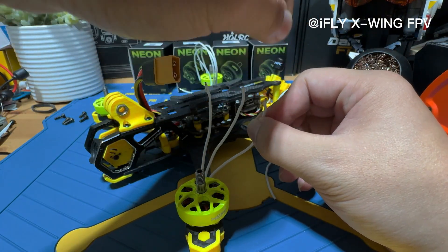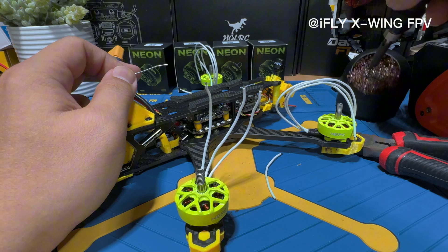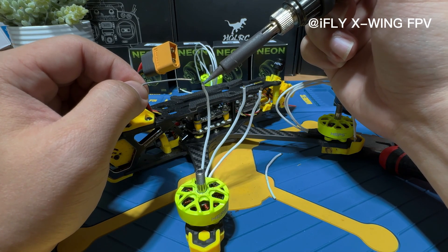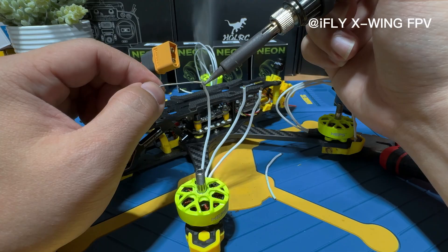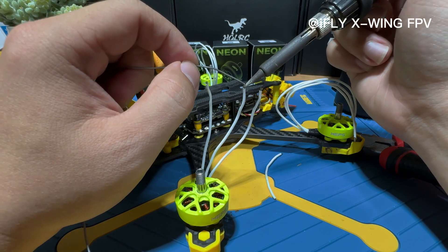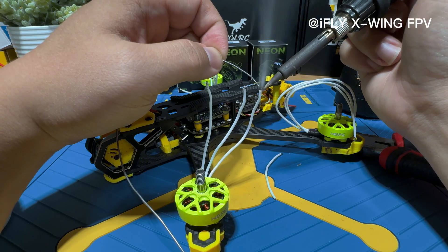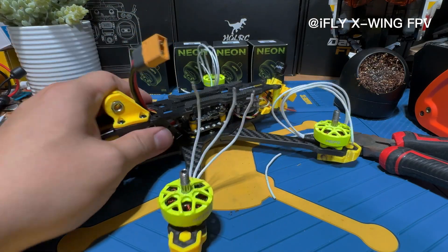The third part is you're going to have to pre-tin these wire tips, otherwise you won't get a good connection. Bring out your soldering iron and your tin — use the iron to touch the wire and make it a little hot. Now since my wires already contain flux, we can kind of bypass this step, but otherwise you should be putting flux on first, which makes it a lot easier.